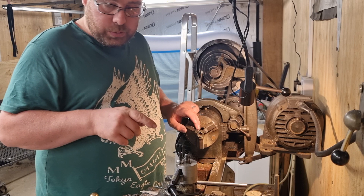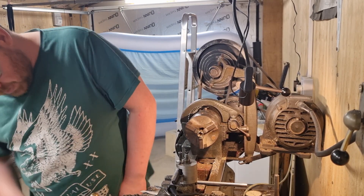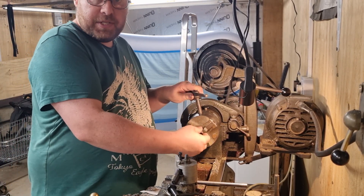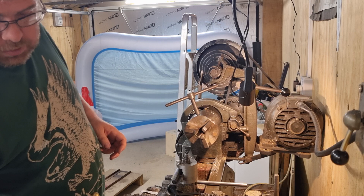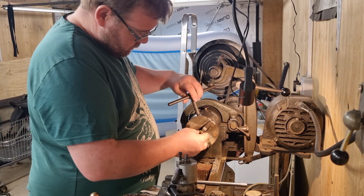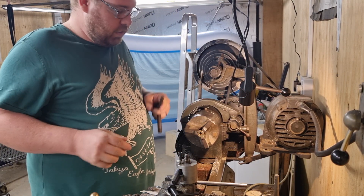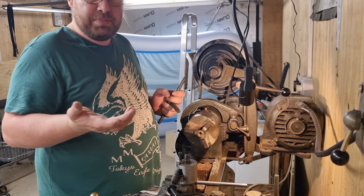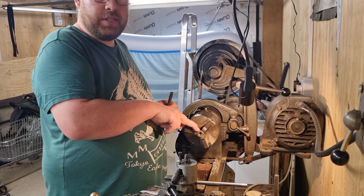We'll take this one out - where's the chuck key? There now. I know you're probably thinking there are a few sharp edges on that but I'll taper them up later on. I've pre-drilled that - I think it's about 10 mil that I pre-drilled it. They're not really any particular size on length because they don't really need to be, as long as there's enough material in there for me to put a grub screw in - drill and tap it.